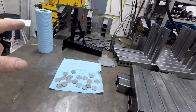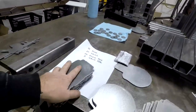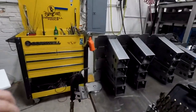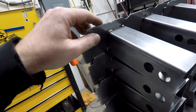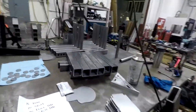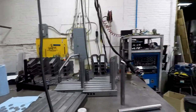There's one right here that I actually welded on backwards — the flag — so I've got to cut that off and probably just weld on another plate. I have extra plates, extra gussets, extra skulls. I was making these without a 16 gauge and welding that to the eighth inch, but with my particular welder it doesn't like the low amperage starts — you really have to give it a lot of pedal, and a lot of times it burns through the 16 gauge. So I think I'm just going to make everything out of eighth inch going forward — way overkill, but the cost difference material-wise isn't much and I'll weld it a lot quicker, saving time on the back end.